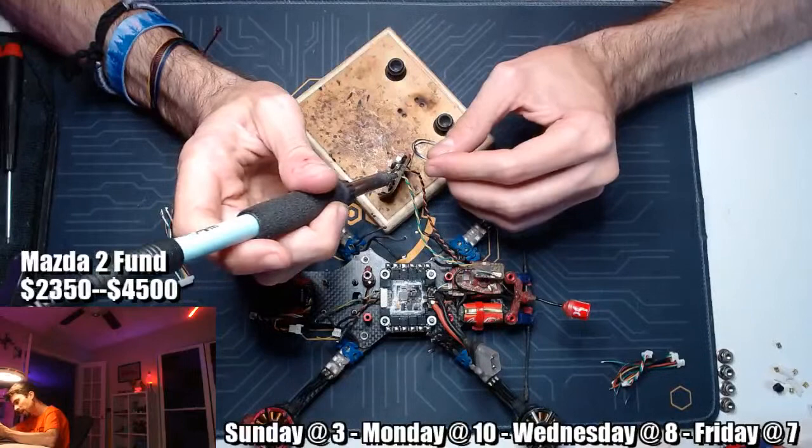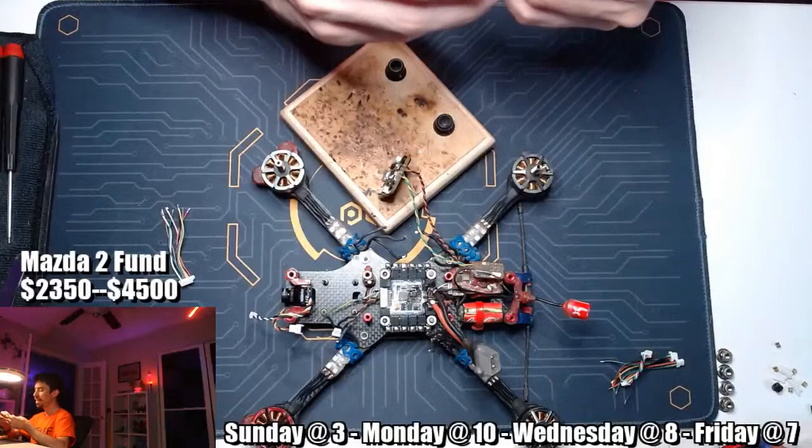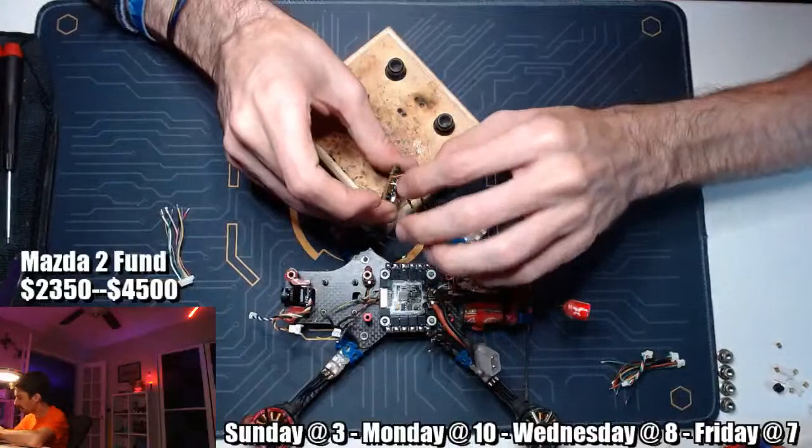And you do want a little bit of a nub of solder on the bottom here, the side that you're adding it to. That's a sign that there is enough solder in that through hole to have that nice strong connection. And then you can just kind of check them on the top here. And we're looking really good.